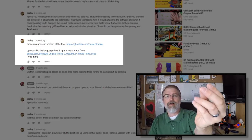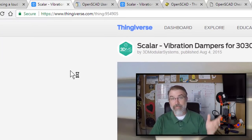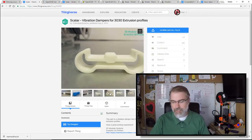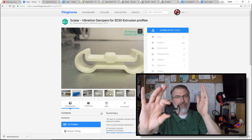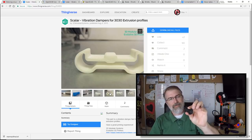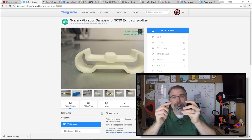The Prusa i3 MK3 out of the box comes with a little rubber foot that goes into the extruded aluminum. I looked around and found something on Thingiverse — Thing 954905 — and printed it out, but it was kind of low. So I printed it taller, about 150 to 200 percent, so it fit the extruder but was a little taller. It kind of worked, but it's a little too stiff for a dampener, and it can fall off — it's not really holding on well. I was thinking that once I learned how to design stuff I could make something that would hook into the upper part of the extruder.